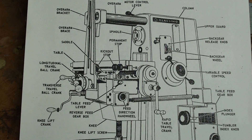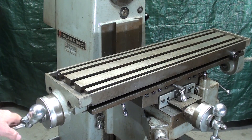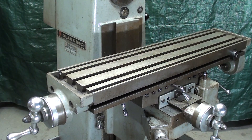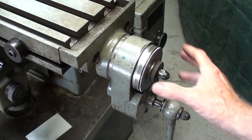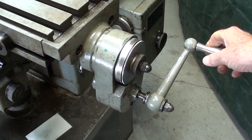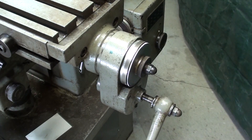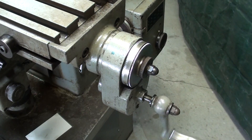This is another page from the Clausing manual showing and describing the parts of the machine — pause your video if you want to study this. The table traverses in this direction, which is said to be the X-axis, and can be moved with a hand wheel on either end. This is the clamp that will clamp it in one position for rigidity during certain milling operations. The table can also be operated from this end — there's a little gearbox here and a crank, and we have graduated dials. This machine is not equipped with a digital readout, but by pushing the crank in we have what amounts to a rapid traverse. By pulling it out, that's just a one-to-one ratio. And then there's a neutral position right here so that if one is using the power feed, this isn't going to come around and hit you. Quite a nice attachment, really.